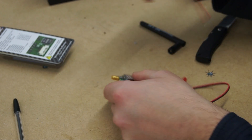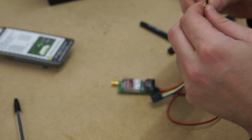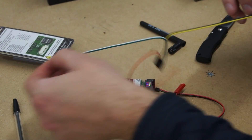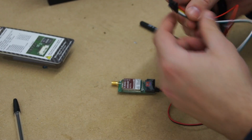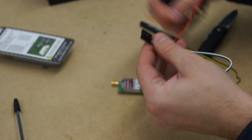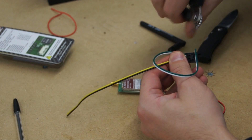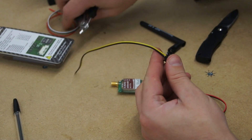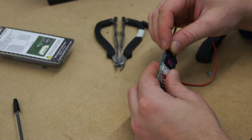Now connecting your power cable. We're going to strip off the unwanted cables — the red cable and the green and white. The red cable is just a 5 volt out, so we can snip that straight off. The green and white cables are audio out cables, and as we don't get audio out from our Zenmuse, there's no point keeping them. What you should be left with is just the yellow and the black — yellow being video and black being ground. Connect this straight into the video transmitter now.